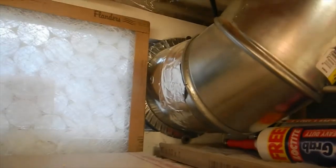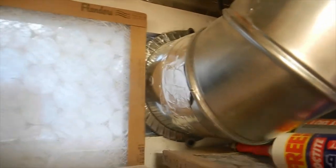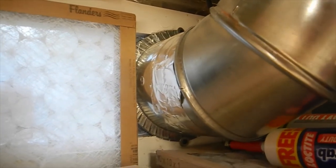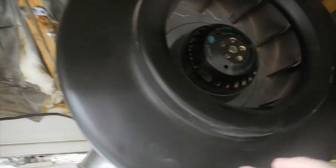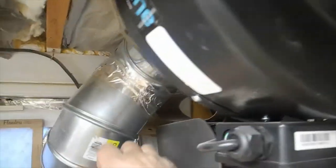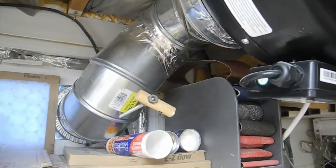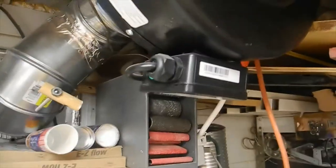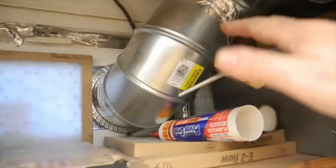You can cut the holes — you'll find the pipe joiners at Home Depot, it's just a way to join two pipes together going outside. This is six inch — I moved to six inch from four inch because I went with bigger fans and higher velocity or CFM. These are fans they use for greenhouses; they're the best and the quietest. Once it winds up it creates — this one is 745 CFM — so it's pushing a lot of air out, which is why I went with the bigger six-inch pipes.